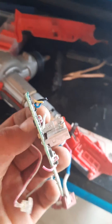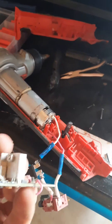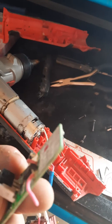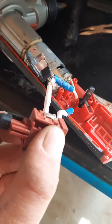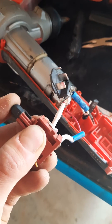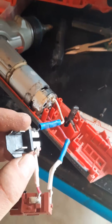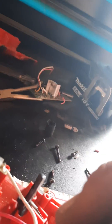I cut this thing out — cut the wires as close to the board as you can, because you're just going to splice them together from the switch and the battery, and this thing just works just fine now.